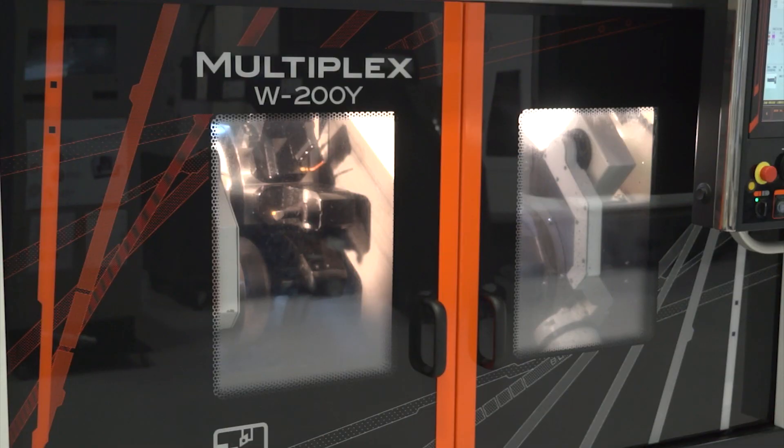And finally, on the tooling on these — what are we talking? A 12 station turret on either side, with all 12 tools driven. The chuck diameter here is normally 200 millimetre, 8-inch, with 65 mm bar capacity if you need that. As a viewer you might look at this and think: great idea in principle, but I need a bigger one. Do they come bigger? Yes, we do bigger ones as well.